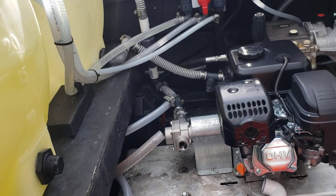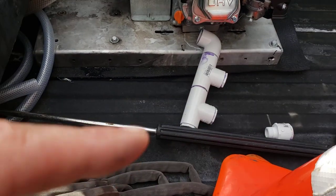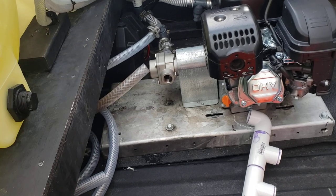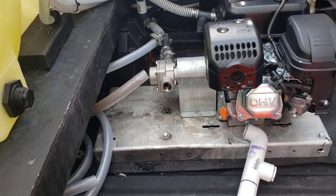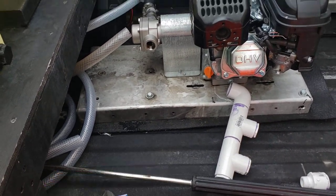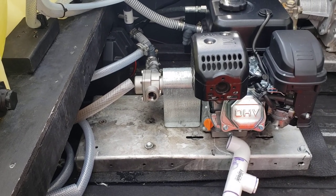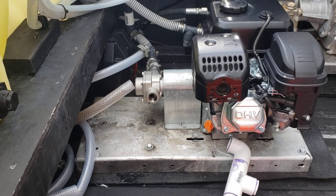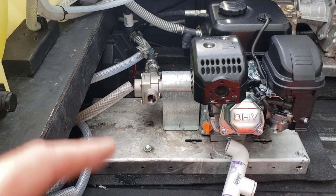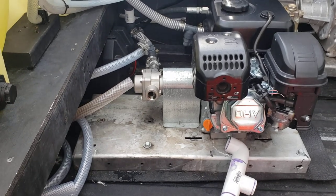I tried so hard. I've been working on this stupid thing all day and I had a PVC manifold that I had directly connected to my pump. But the vibration — I can't tell if it cracked the PVC or if it was just blowing past the Teflon, but I wrapped the threads like six times. I've never had anything blow past my threads wrapping Teflon six times, so I don't know if there's like a hairline crack or something. I was testing it out today, 40 minutes in and it started spurting out water on the pump connection.